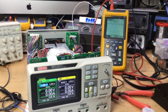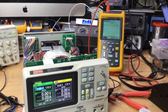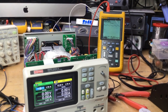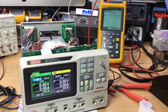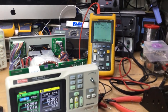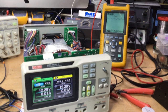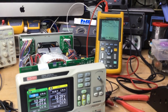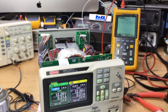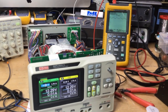but we ain't getting that. So once it gets down to about 5.5, that's when it'll click off again. And then because the bridge rectifier is getting very hot at the moment. Now it exacerbates it when we switch this into parallel mode with all the outputs on, and then you'll suddenly see it'll really affect it, and then suddenly it'll go off, which is very shortly at 5.4 volts any second now it'll go off.